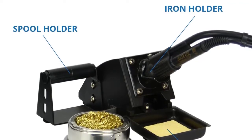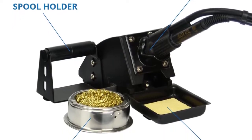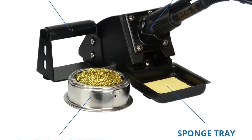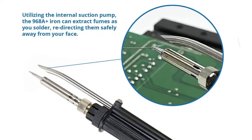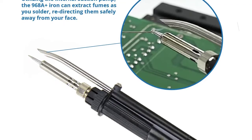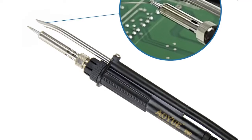Over 50 nozzle sizes available; five nozzles are included: 1124, 1130, 1196, 1197, and 1313. Also contains an assortment of 10 soldering iron tips. A powered vacuum pickup tool is included and can be used to pick up small ICs. Intelligent functions include auto nozzle cooling after reworking and auto sleep function when placed in the hot air holder.